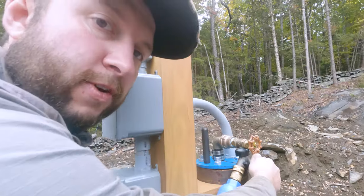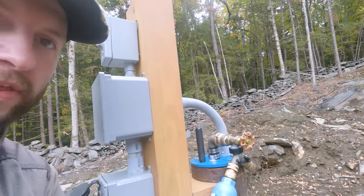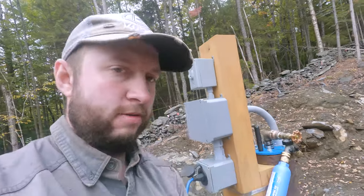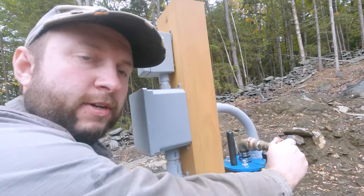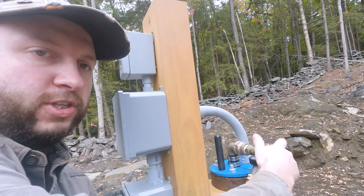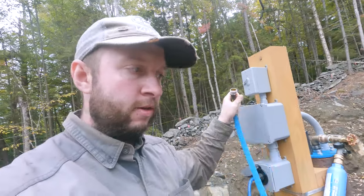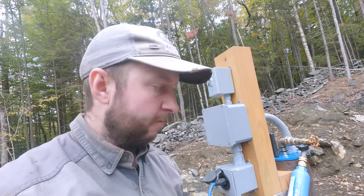What I can do is actually open this other valve here, so water will spray out that way and make sure the well pump isn't pumping against a closed system. I'm going to open up the valve on here and open up that faucet, then I can turn on the well pump and with any luck that will start running. So here we go.